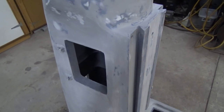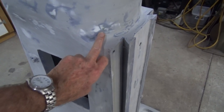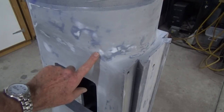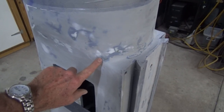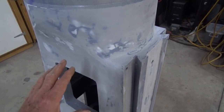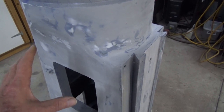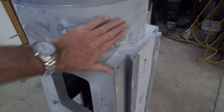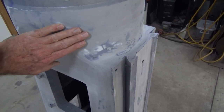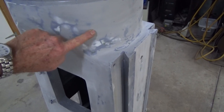And then I've gone over the mill with an etch primer, which is this dark grey finish that you can see here, and then a sealer surfacer. The important thing here is that even though you spray on these products, that doesn't help you in getting a smooth finish ready for your top coat. What follows after that is lots and lots of sanding and lots of preparation. And even though I had sanded all of this machine with an orbital sander and hand sanded it, there are always going to be imperfections which don't show up until you've got your second coat of finish on.